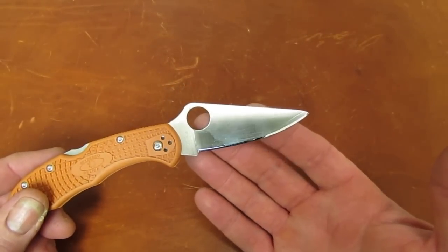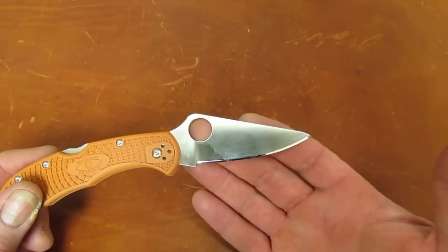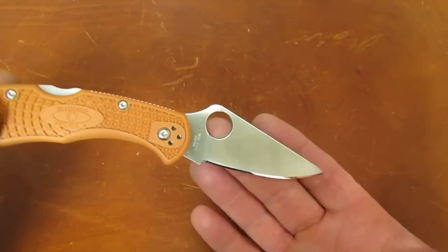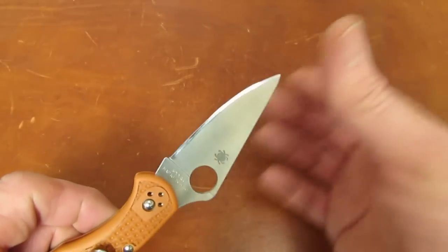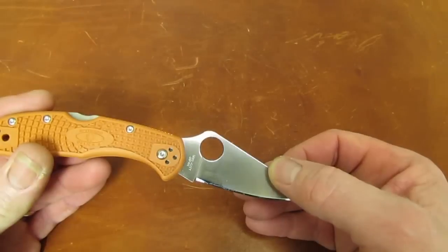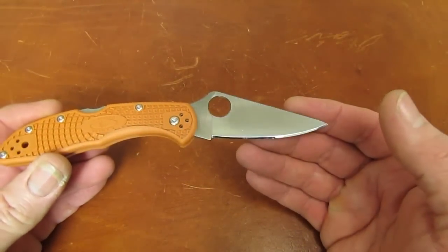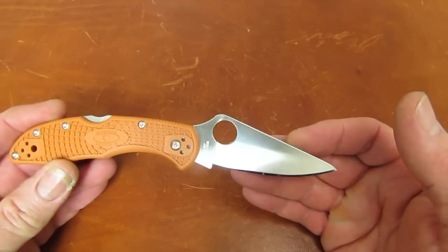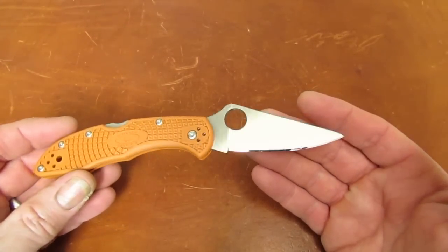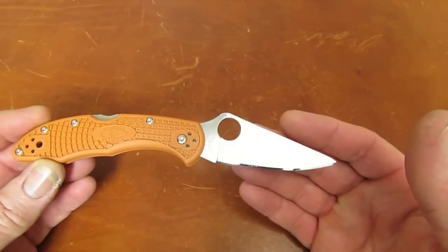This steel has cobalt in it, it's tungsten rich, it's vanadium rich, only has 5 or 6% chromium, so it's not very rust resistant. Not super high carbon. I think it's a little less carbon than ZDP. So the objective from Hitachi was really to make a kitchen knife steel that would have those toughness and edge holding characteristics of CPM M4. And it seems like they've done it in a very big way.